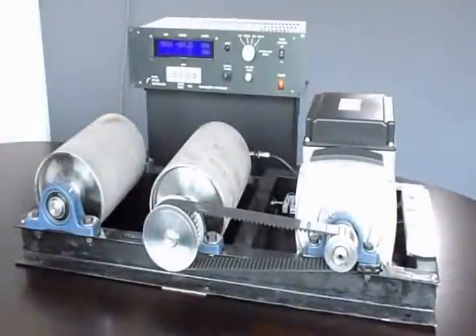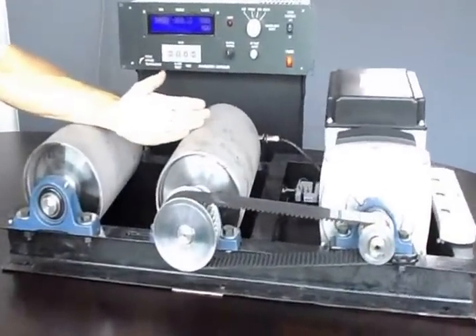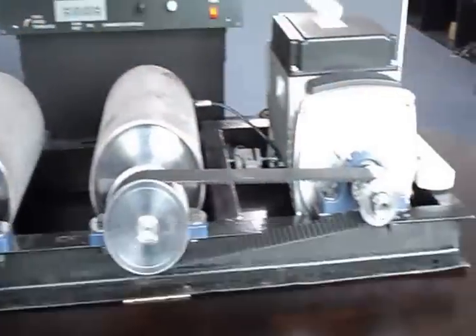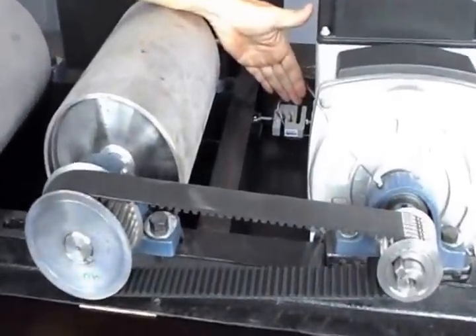This is a Ply Technology Baby Chassis Dynamometer for motorcycles. The wheel of the vehicle under test sits here between these two rollers. The front roller is an idler roller preventing the vehicle from running away, while the back roller is the driven roller transmitting torque through this belt to the dynamometer. It's suspended in bearings fore and aft, and torque is measured from this load cell.